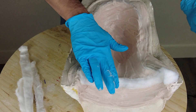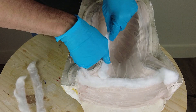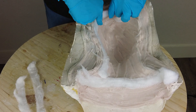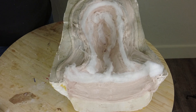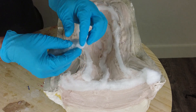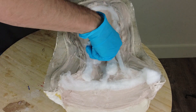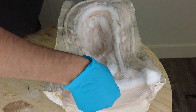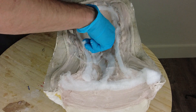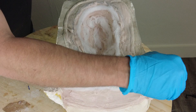This step must be done while the silicone is still uncured and well before it starts to gel, to ensure that the silicone really soaks into that cotton fiber. If you're working with a multiple-piece mold, you want to do this and then close the mold, make sure everything is in place, and then seal it up. The whole point of doing this with an open-faced one half of the mold is just so you can see what's happening for this video. Because silicone will naturally repel polyurethane and polyurethane will naturally repel silicone, the cotton fiber creates a mechanical linkage between those two dissimilar surfaces.